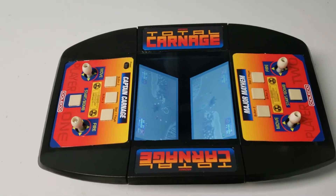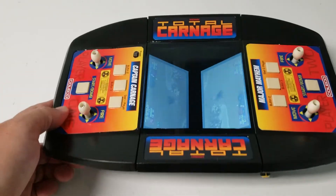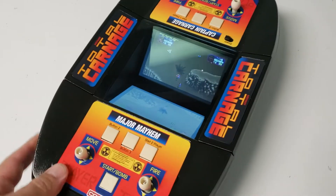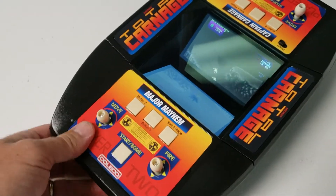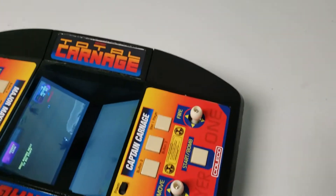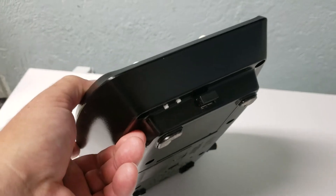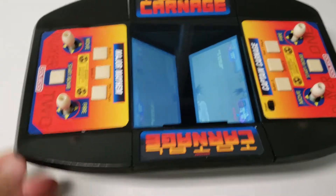Basically it's a Pi 3 in there, lithium battery. I chose a different power supply for this thing because it takes up quite a lot of current — the regular 1000mA just didn't do the trick. So I found this other one — I forgot the name of it — but it puts out about two amps, which is perfect for this. The battery will actually last quite long. You have your charge indicator there and USB right there. There are the two buttons that you would use to start and stop.